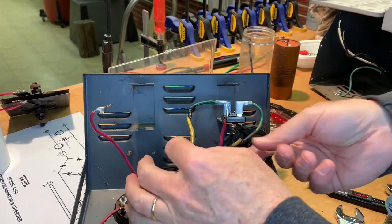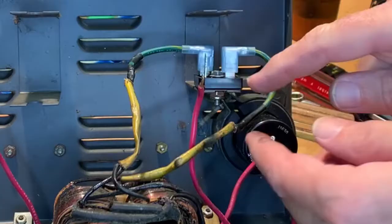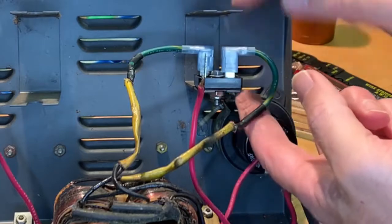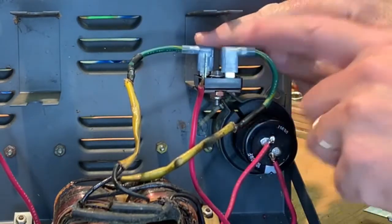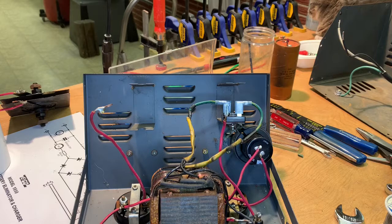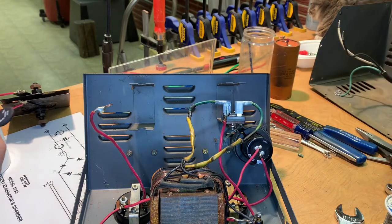All right, now we've got these two wires. Actually, there's two wires in each of these that are soldered together onto this one wire, and then I have a terminal here, and then we're hooked onto the bridge rectifier on these two opposite corners here. Yep. We need to hook up the downhill side of that rectifier and figure out a place to put your thermistor and the relay, whatever that really is.